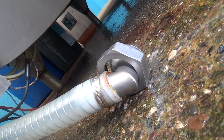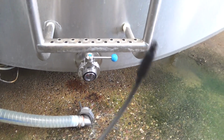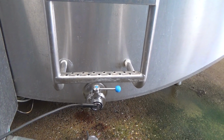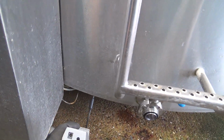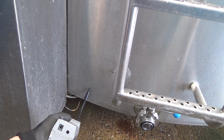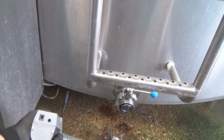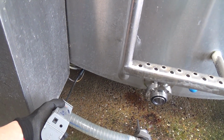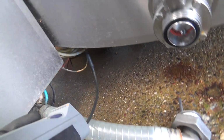But we're getting something it doesn't like in there. What you get is when there's milk in the tank, the weight of the milk quite often seals the leak back up, so you only get a little residual bit in the jacket, because this is double skinned. You've got an inch or two of foam and then the inner vessel where the milk sits, so the leak's got to get through the foam to the outer skin and then find its way out somewhere. It doesn't like that much.